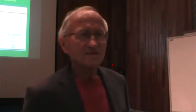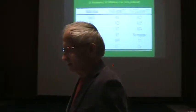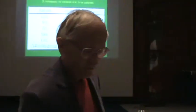I mentioned yesterday that these four types of transducers, conductometric, bulk wave, QCM, surface acoustic wave, and Schottky, are not all available options because there are several other transducers which could be used. Of course, in my opinion, the best at this stage of development in nanotechnology, the most promising are optical. But you can also use different types of MOSFETs. You can use different transducers, and combining them with different materials, you can obtain fascinating results.